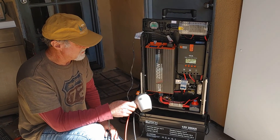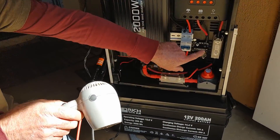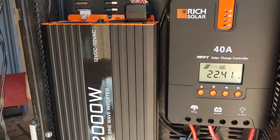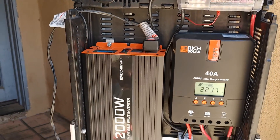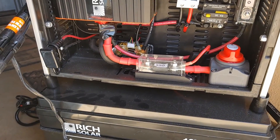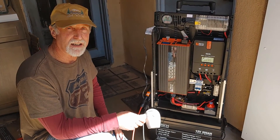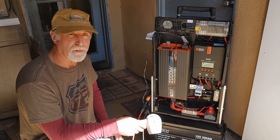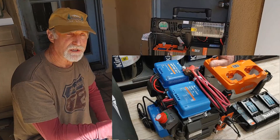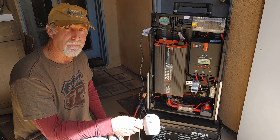So hopefully this is helpful to you. It was fun to build and maybe you can build something like this too. You just have to put your fuses in, your switch for your charge controller — those are the main concerns. And then you want to have a plug in for your solar panels. I put an Anderson plug in the back for these guys because the regular solar panel plugs are so hard to plug in and unplug, so it makes it more portable. Anyway, that's about all I've got for today. If you have any questions, just comment down below. If you like this kind of content, consider subscribing. I've also got a video on solar fans and another video on another power station which you can charge with your alternator, with solar, and with shore power. Check it out — thanks for watching.